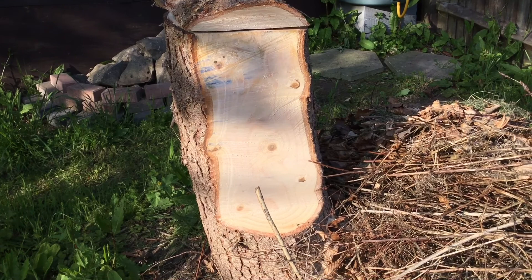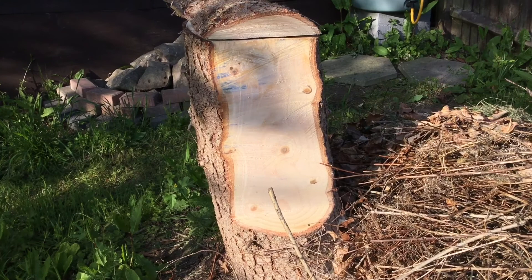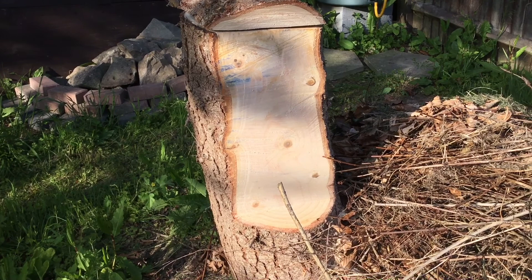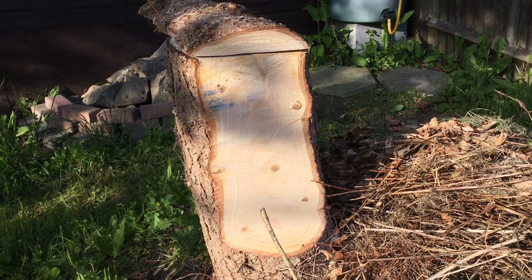For this one in particular, it was too good an opportunity to miss. So I've taken the front off — that will be the roof and it will be full of holes. I'll cut to it in a second, missing out a few weeks, because I have to let this wood season a little bit. As I've mentioned in other videos, it's very hard to get a clean hole in wet wood, and live wood is wet wood. So I'm going to wait a few weeks, let it brown off, and then drill the holes.